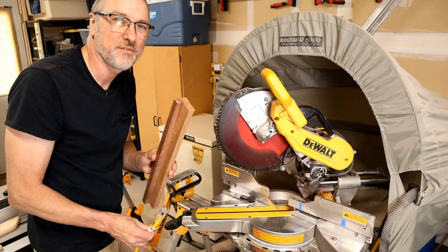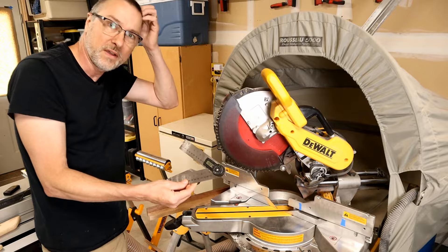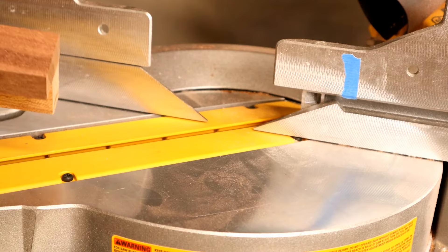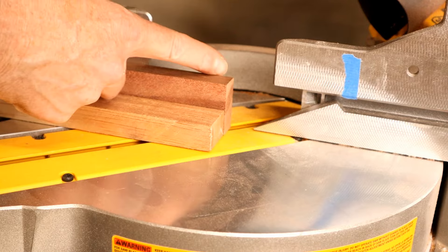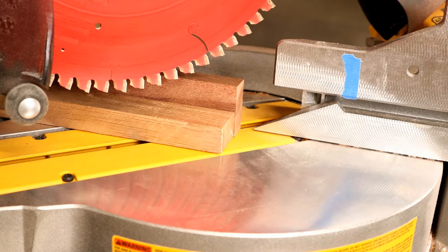Now it's time to make a 45-degree cut off the end of each of the four boards. It's important that you dial your saw in, so first order of business is to make sure it's unplugged — you don't want to be known as three-finger Jack who used to make floating frames. I've got my digital angle finder set to 45 degrees. Place the face of the frame up against the fence, slide it over so the cut goes all the way through — that's why I gave myself an extra inch, so I can take approximately a half inch off this end, then flip it around for the other side.